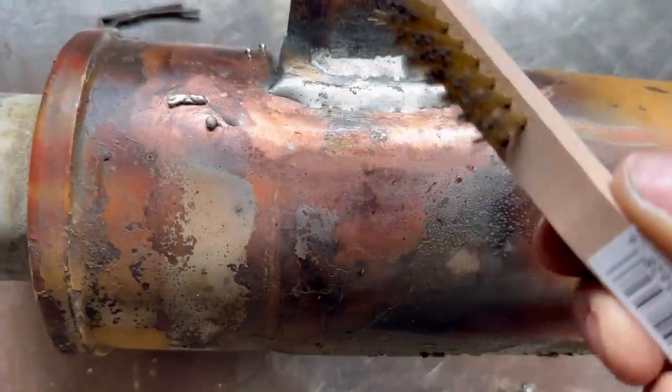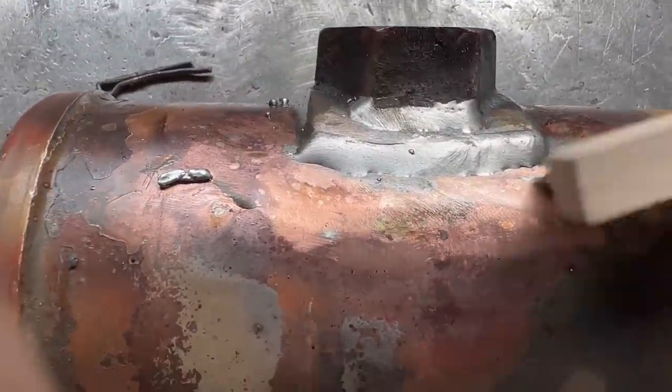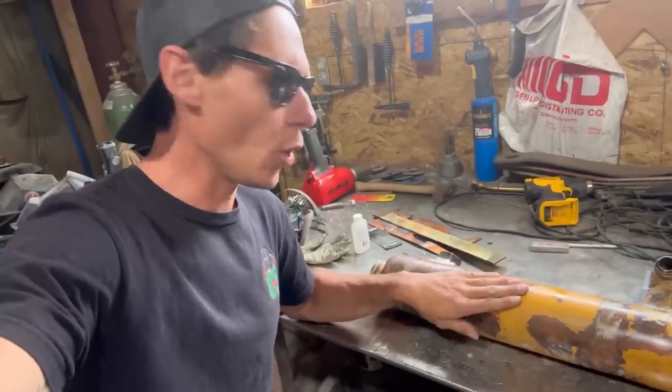So that's what we've got right now. I'm going to get a wire brush on it and just lightly touch it after it cools down to make sure there are no pinholes anywhere I can see. Hopefully we've got this thing beat and this guy can put his machine back into service. I went and got a brass wire brush specifically for this job. Oh yeah, that looks good — that looks real good in my opinion. I don't see any pinholes. As far as I can tell, that's good to go. You can see it looks to be a solid braze there. So I'm going to go ahead and get a hold of the customer and tell him I think we have a successful braze, and see if he'll allow me to film the install. Because I want to see if it leaks — I want to see if my work was successful. I've never done this before and I'm pretty proud of myself as of right now, but we'll really see when it gets put to the test.